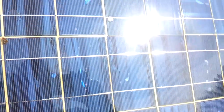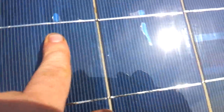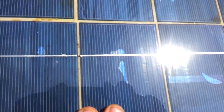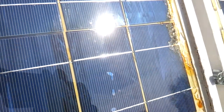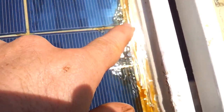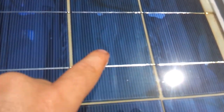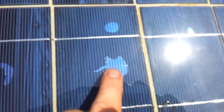Here's the second panel I made. The second panel has a lot less air bubbles in it. Now these cells I bought off eBay separately, a different time, and put the thing together in the same manner. What you see here is a bad mix of the solution that I poured over it — it wasn't cured or mixed properly, so this is what I ended up with. You can kind of tell how that material yellowed, going from the pure white right on the glass to this. So it did yellow a little bit, probably causing a reduction in output from the cells.